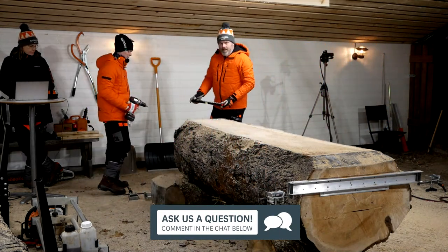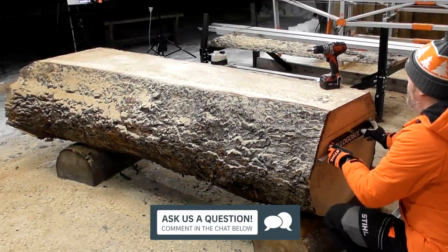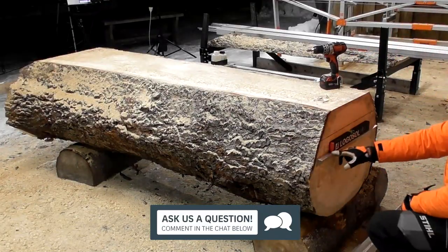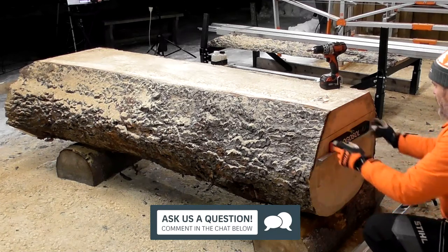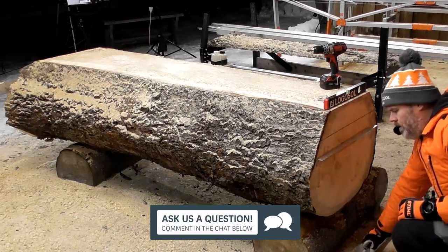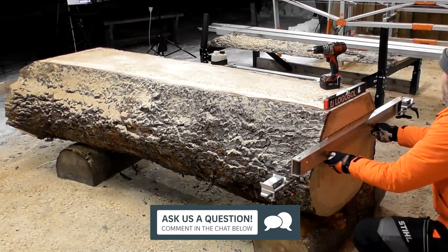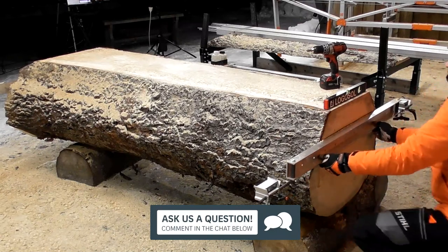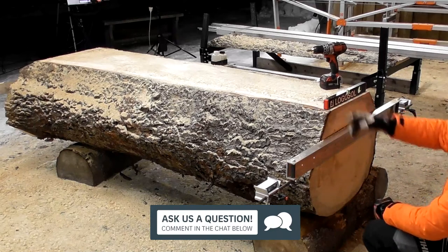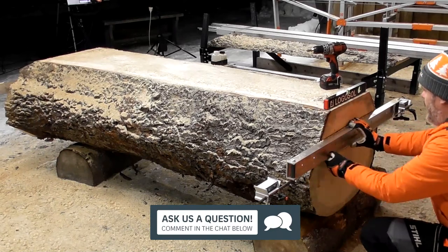And we'll do the exact same thing here. Put the spirit level on top of the profile. Screw the profile into the log. And when that's done, put the guide rail holders in position and line them up with the bottom ones, or with the ones in the other end of the log.